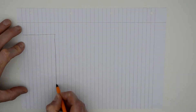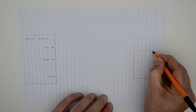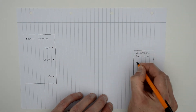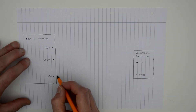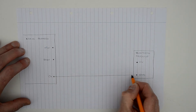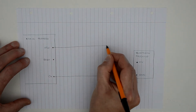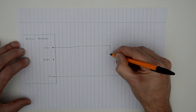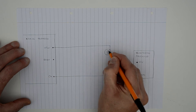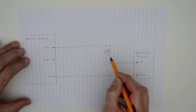Here's a simple sketch of the main board and the Bluetooth module. I now just need to figure out a way of switching the 5-volt supply to the Bluetooth module using the standby signal on the main board. The zero-volt rail on the main board will go directly to the ground connection on the Bluetooth module, and the 5-volt rail will go to the Bluetooth module via a transistor.